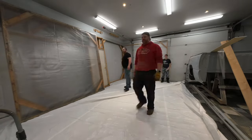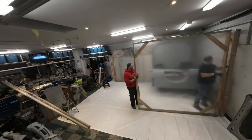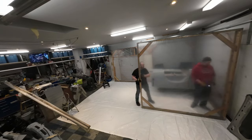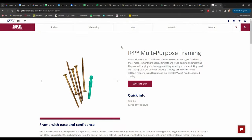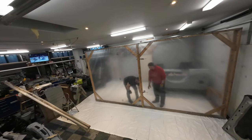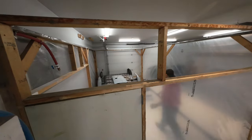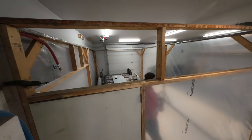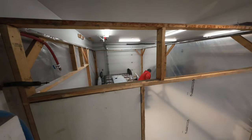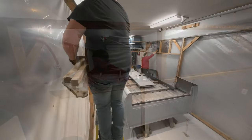The floor is a tarp I got from Princess Auto — about 16 feet by 14 feet. Now I'm screwing the ends in with a GRK R4 multi-purpose framing fastener; these are really good for cinching them together. The sides are held together with carriage bolts because they have to be really strong. The GRK are good long fasteners — four-inch — and they really suck the boards together because you don't want an air gap, and conventional construction or decking screws just won't cinch them quite as tightly.